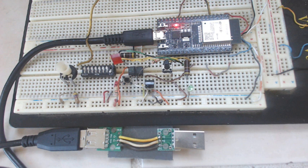The contacts on relays usually have tungsten embedded in them for wear resistance. In our case, of course, these cables are brass on brass — and this is not a recommended combination when you're trying to transfer current, especially if you're going to be interrupting the current when brass is on brass. You're probably going to create a very small arc if the brass is not sufficiently large enough to carry the current, causing the brass to erode or pit. Let's take a look at what you can get away with as far as current going through a contact surface or a given wire diameter.